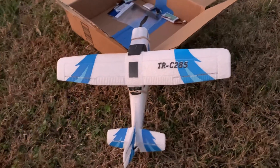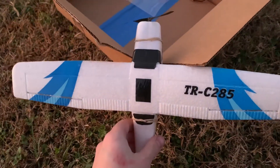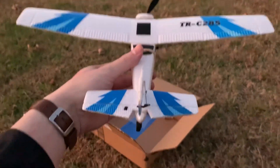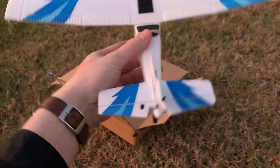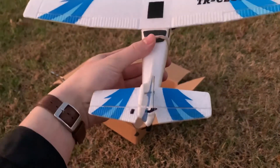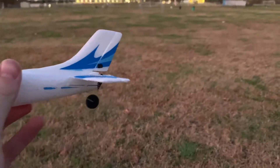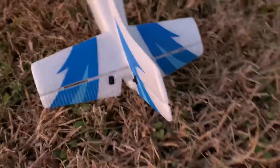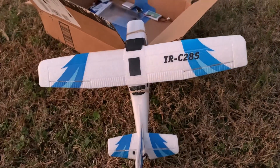Then we'll go fly the plane. I have the plane jammed into this box here. The stabilization feature is on, which means that when we throttle up, it's going to try and keep our plane level. You can actually probably see it if I start to move it around. Let's just yaw real quick and take a look at the rudder right there. It's a little hard to see. And then the elevators should be a little bit easier. You can at least hear that it's trying to correct. The natural position of these things is that they're pretty centered. So when I throttle up, it's going to just stay in place.